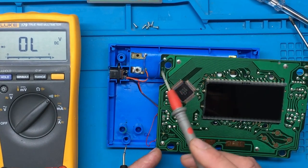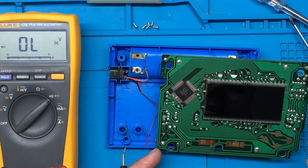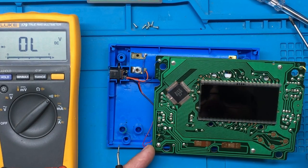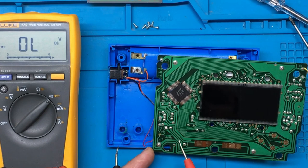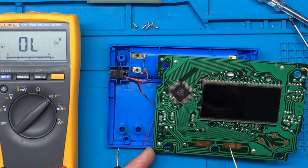It's got there minus 6 volts which goes to the negative terminal, but then it goes to the positive terminal on the cold cathode tube, which is rather odd. I've got a J-plus and a J-minus here. Let's try and trace those — that goes along here and then that goes to the power switch, and it goes to the transistor over here.